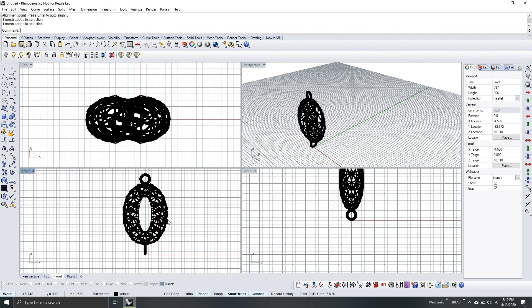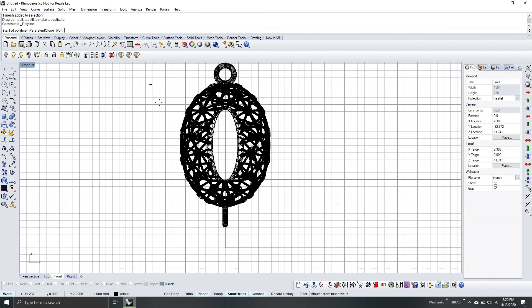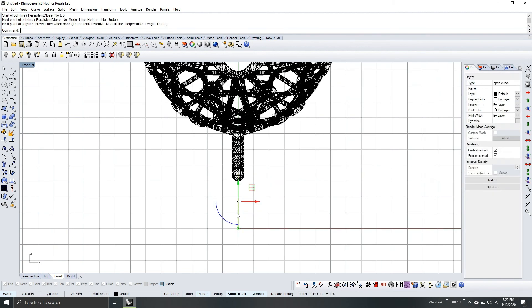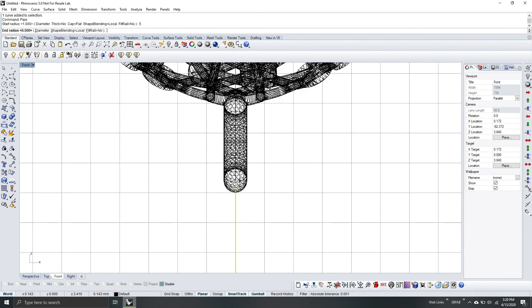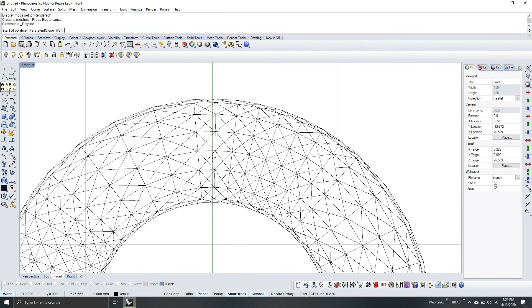We will not put the supports first — we will add the casting way first, and then check if there are hanging parts that need to be supported. I'll go to front view and drag the model up because I will add a base here. Firstly, take my polyline, type 0, then connect it to the model. My base will be bigger because it will be the starting point. I will pipe now — pipe 0.5 as the base, and the end point will be 0.3.